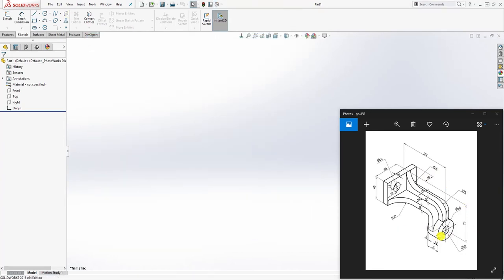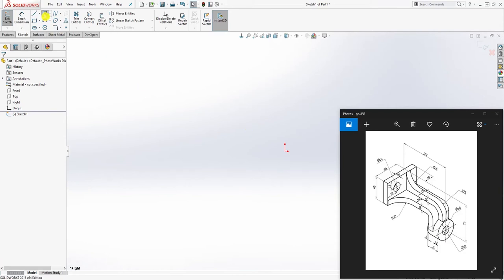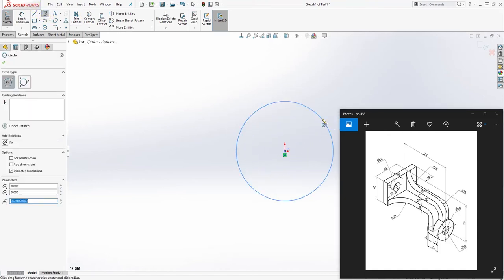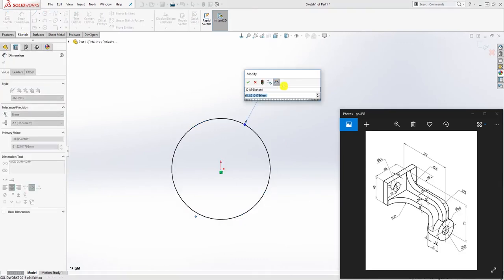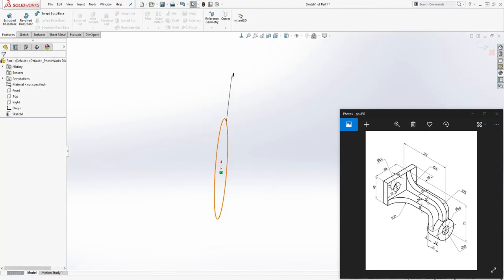And the first thing we are going to start is with this cylinder, and we're going to draw everything back. So to start, I'll just click on sketch, and looking at how this cylinder is faced, we know we're going to be drawing it on the right plane. So click the right plane, and I'm just going to draw a circle in here, something like that. And I'm going to add my dimension, and it is going to be 38 diameter,